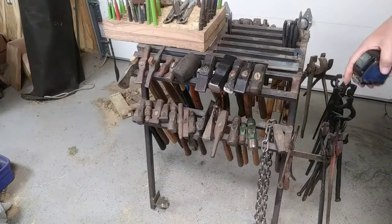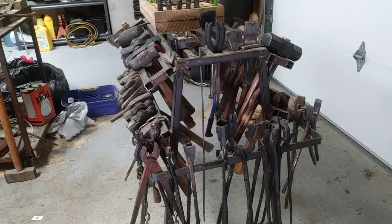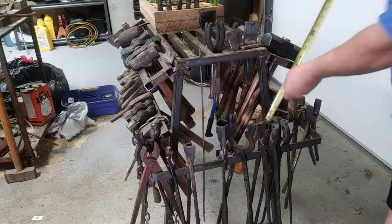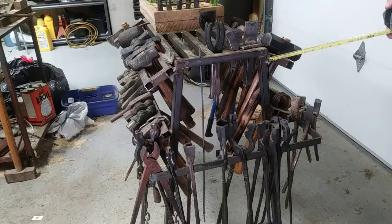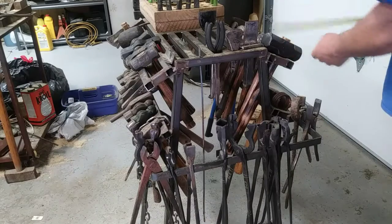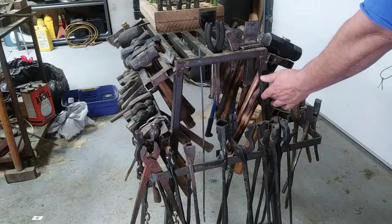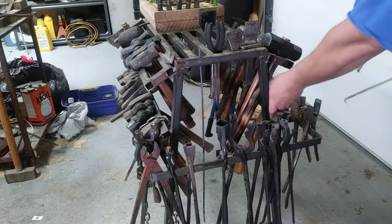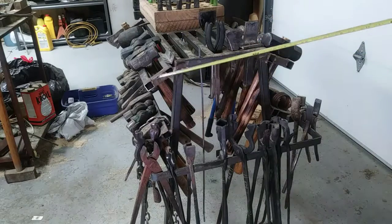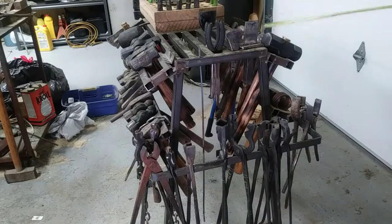I had to come up with an angle so these pieces would go through and not hit down at the bottom. I wanted them to come in at an angle — I knew I wanted them about eight inches apart, from corner to corner. After getting the angle I wanted, I used a speed square since I didn't have a protractor handy. I laid the speed square in there, took a picture of what it looked like, noted the number on the scale, and used that same number to keep my angles consistent for all four pieces. They're only welded at the tops and bottoms on each end, but it's way strong enough for hammers.